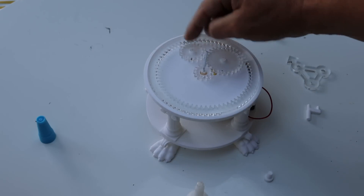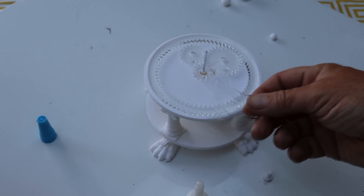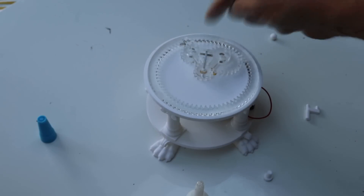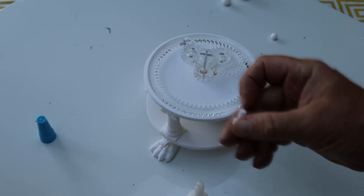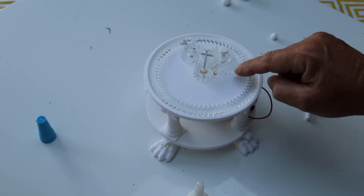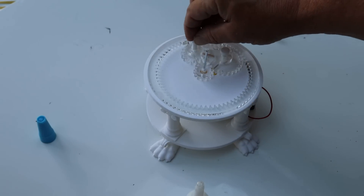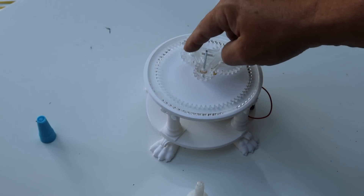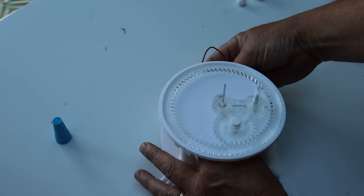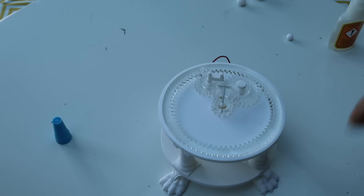Take the medium gear and drop it in behind. This is the carriage that holds everything together, and it goes on with the arrow above the medium gear. Then take this pin and pop it through there, pushing it through the large gear. Then take this pin with those two bits and push it through, forcing it into the small gear. And when that's done, you can put the planets on.